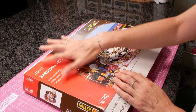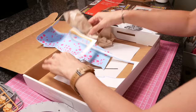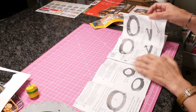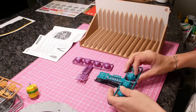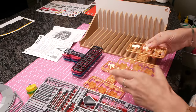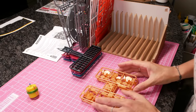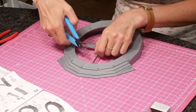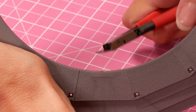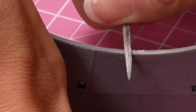The heart of this model is a Faller Flipper. It's like a merry-go-round that goes up and down and you spin round and round in cups whilst it's doing it. Like all kits, you get it out, read the instructions and organise everything so you're off to a good start. Whilst the kit comes with a 16 volt AC motor to make it go up and down, if you want to light it you can either buy their kit or do it yourself. A large proportion of time is spent cutting apart pieces with nippers, tidying them up with even better nippers and then filing bits flat where there's a nub remaining.